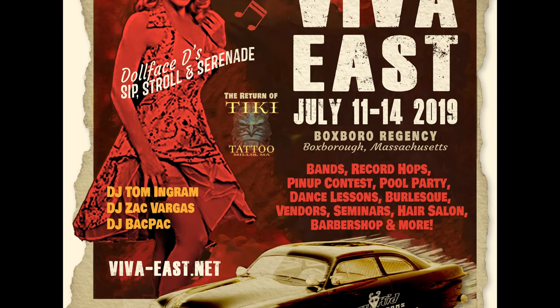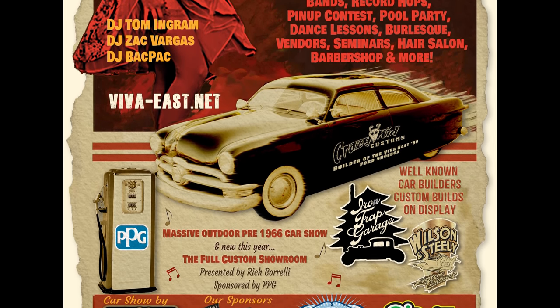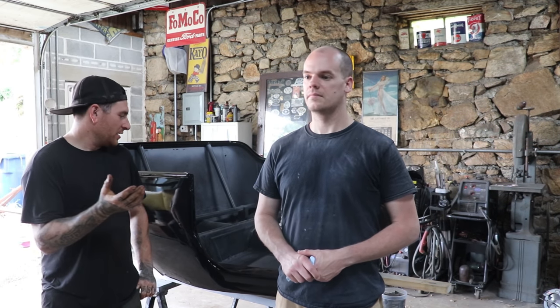Yeah, so we're actually sending the tub away to get upholstered really soon. We're doing a debut of the car at Viva East in Massachusetts in the middle of July. Mike's gonna drop the date and info right there. So we're trying to get the car ready. We're gonna go over and do the first round of nib sanding, buffing, color sanding, all that stuff, so that the upholstery guy, we don't have to do that work around his nice upholstery. So we're gonna show you the process. Mike's done this a lot, so I'm gonna let him take the lead and give you some tech tips, but hopefully there's some little things with correcting the paint and getting it nice and flat that'll help you guys. So let's get started.